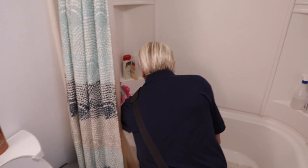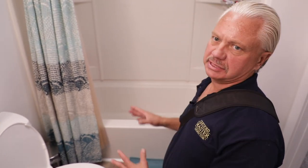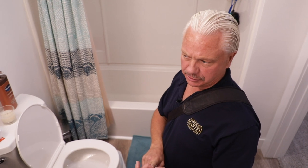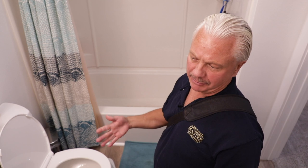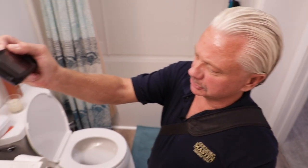We run a lot of water — I want to put a couple inches of water in the bathtub anyway. If it is a shower, we do not plug the stopper and do a water test of the shower pan. It is not required per international standards of practice; in fact, it's discouraged because if it does leak, you will damage the house and you are responsible. So do not do a water test on a shower — just run it as normal by opening up the faucet. Our stopper is holding, so we will take a picture of the water in there.